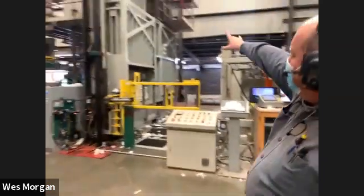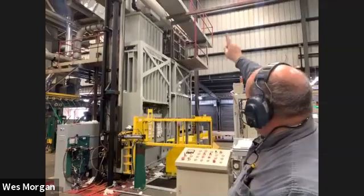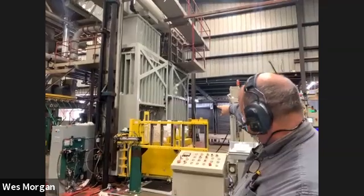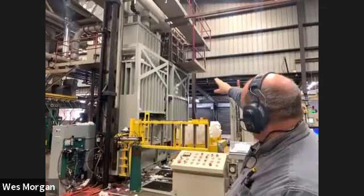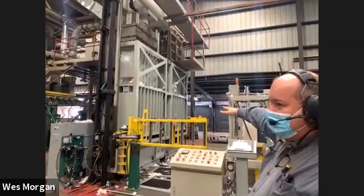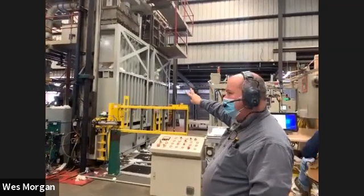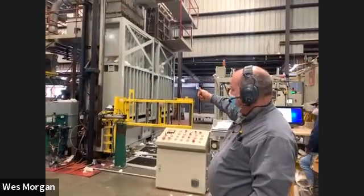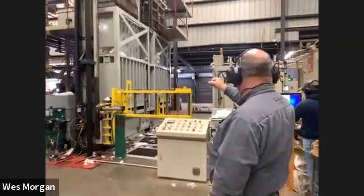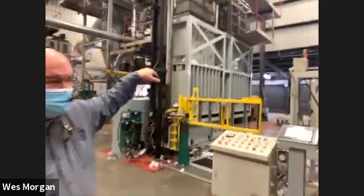If you can see right over there where there's a catwalk, with little red handles, there's a cylinder going up and down. So it's pressing cotton and putting it into the far box. We just emptied this box, but it presses that cotton into that far box, and once it says there's 500 pounds in there, it'll actually jump up an inch and spin that entire press and sit back down. So it takes the empty box around to the other side, and the full box will come over to this side. It'll take about another minute before that happens again, I think.